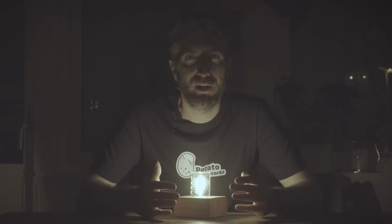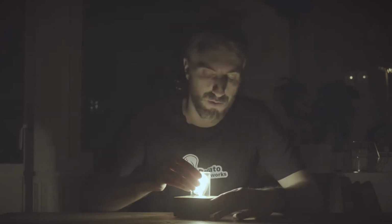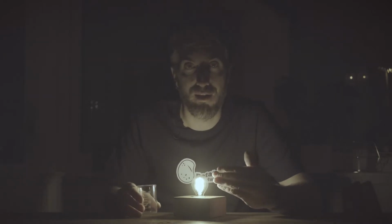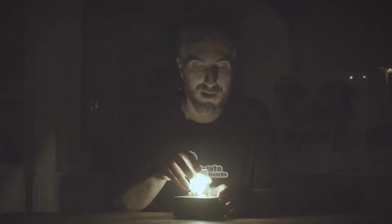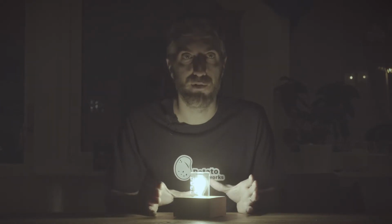So in this video I'm gonna go through the whole process of me building this lamp, consisting of a chemical glass, like the ones that they're using to mix stuff, an LED light bulb, an E14 light socket, a lamp socket, a dimmer, a nice cable, as well as some walnut that I mitered on all of the corners as well as on the lid, so that there's no end grain visible, which gives a very nice look.